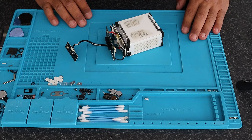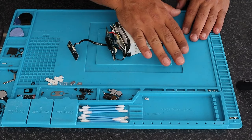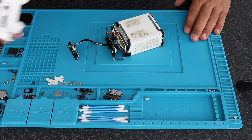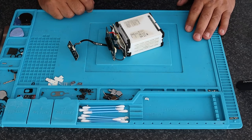If it does not run down, you can then give it a full charge. Thereafter, we plug it into the PC and use software to clear the actual error code on the BMS, which has locked out any kind of charging capability. If we can clear the error, we plug it into a Phantom 4 charger and see if it charges up fully. If it does, we're in a good position. Then we pop it into a drone, temporarily put on covers, and give it a couple of flights — a couple of discharge and charge cycles — to see that it drains all cells evenly. Make sure temperatures are good, and then the repair is done.